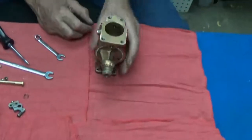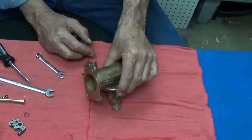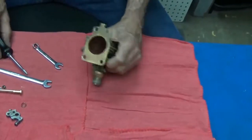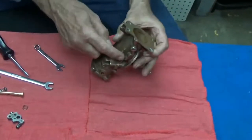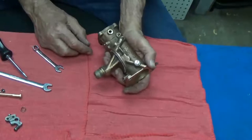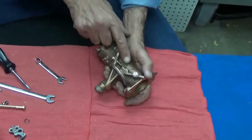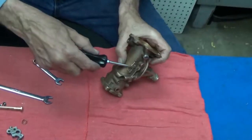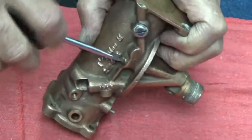Now since we want to cook this thing overnight in chemicals, we'd like to remove every screw and every piece from this body so the chemicals can get into every passage. There's a screw in there, and there's another one right there. The reason they're there is because as they machined this casting at the factory, they had to have access to those passages, and then once they had access, they had to plug the hole where the tooling had gone in. So I'm going to remove that screw which plugs up a passage.